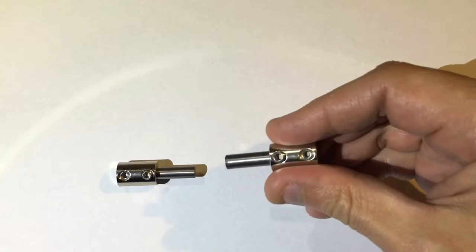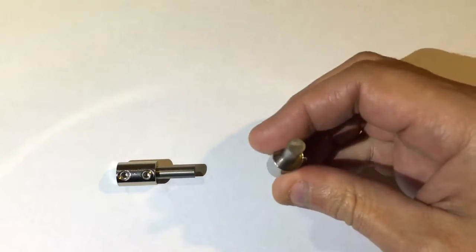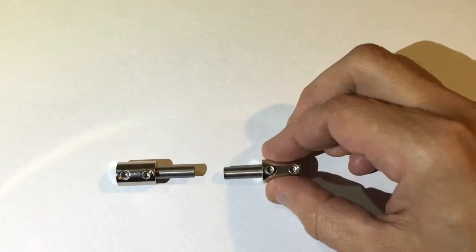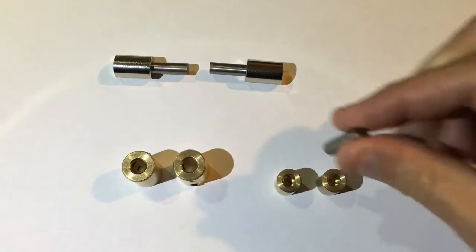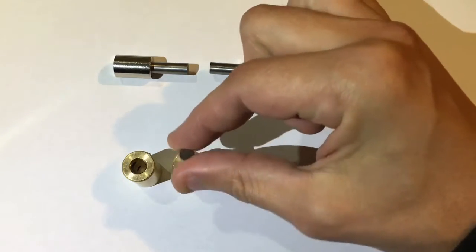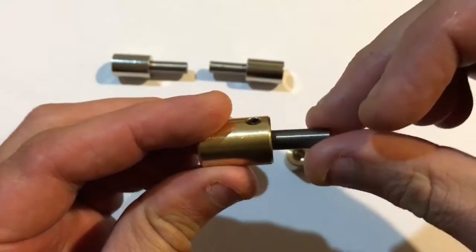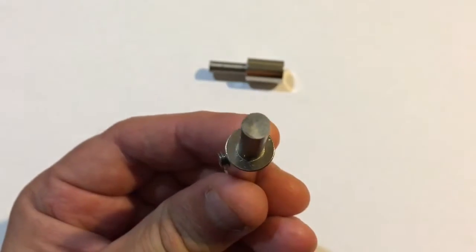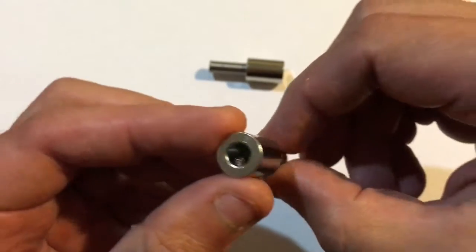It's taken me a few tries to get a suitable shaft coupler. I had to go imperial to match the tungsten rod, which is quarter inch. If you use 6mm or 7mm, you'll find it's either too tight and doesn't fit, or once you tighten down the grub screw the tungsten rod is off-center, so you have something that's not very aligned. The quarter inch shaft coupler — I had to hammer the tungsten in slightly, so it is a real good fit and I'm really happy with it.